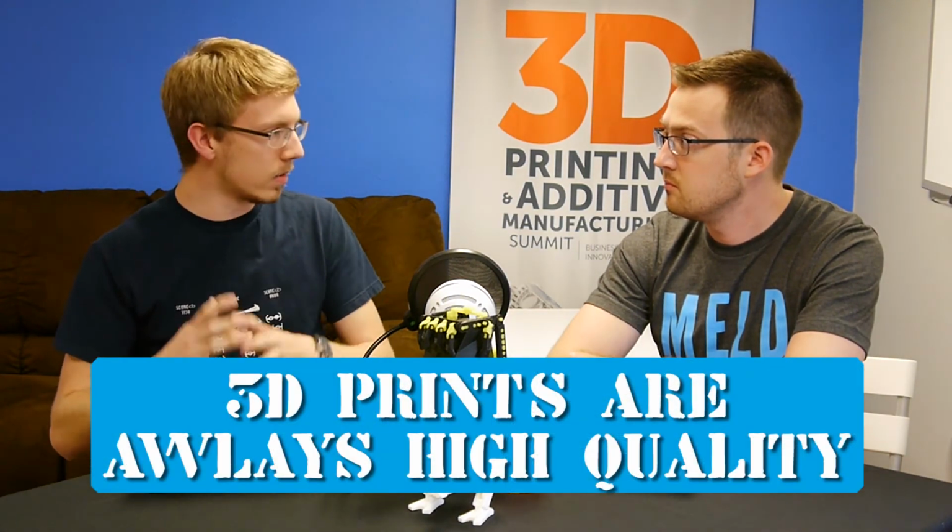I remembered my point that I was going to make. So when he was talking about upgrading the machine so you can print down to like the 25 to 15 micron layer resolution or something along those lines, at that point, you might be better off just going out and contracting to have an SLA or SLS part done, because the time and material and supplies you're going to need to get your FDM machine to get to that point, and some of the issues you might run into, isn't worth your time, to be honest, where you could just for a little bit more money have Fargo 3D Printing contract your SLA part so that you can have that high quality part right away instead of trying to work with the FDM machine. So again, myth 4, plausible. Just depends on your definition of high quality.